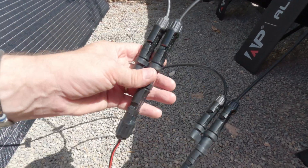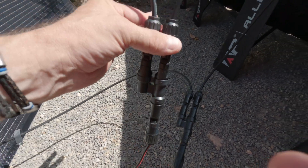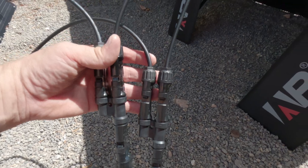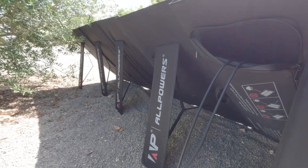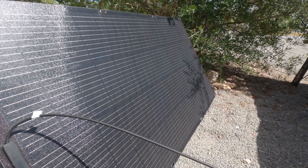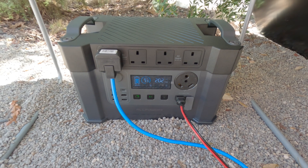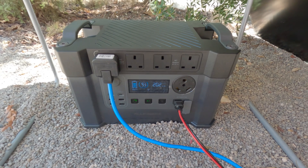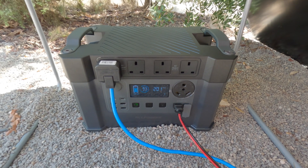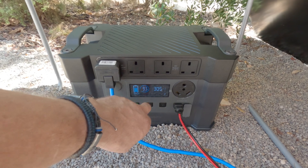Just to quickly show you, you can get these little link clips here — this is the link in the middle — and you just join the two solar panels together and then run your cable to your power bank, doing that for the plus end and the minus. That's how you can get the 400 watt and the 200 watt combined. Just bear in mind there is a maximum capacity for the power bank's intake. After turning the AC off to see what solar we're receiving, it flipped over and we've got 305–306 watts coming in.